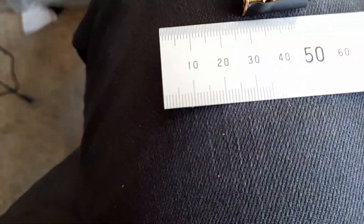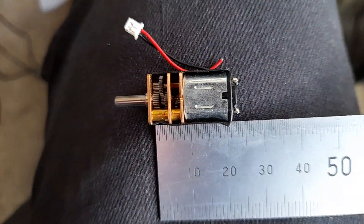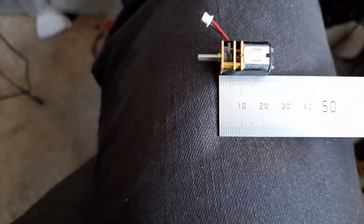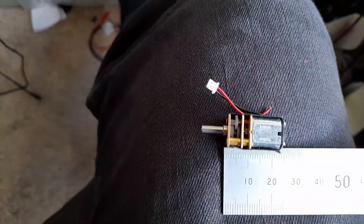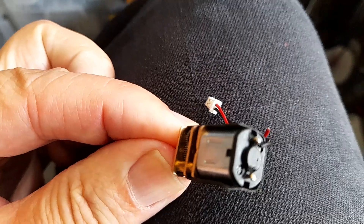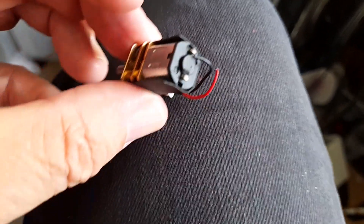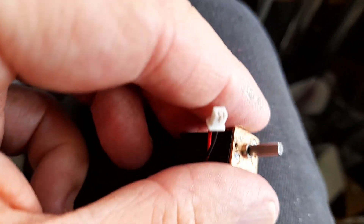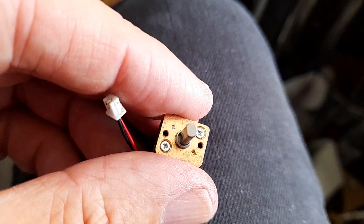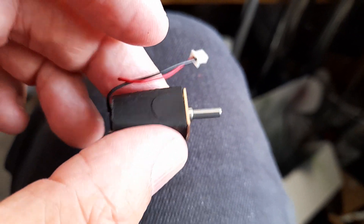Let's just put it across and you can see what size it is. Its overall length — gearbox to motor — is 21mm. So 21mm overall, and in section it's 12mm. It comes with this protection on, but that's neither here nor there. Standard 3mm D shaft.